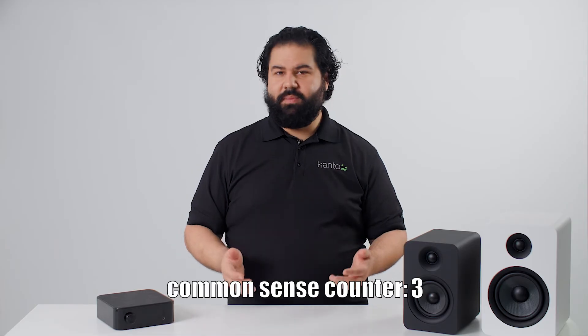The second spec is power, measured in watts. Some speaker manufacturers will give you a range of wattage you should use with their speakers, and others will give you just a maximum wattage. U-Passive 4-inch is spec'd at 70 watts per speaker, and U-Passive 5.25 is rated at 100 watts per speaker — that's the maximum power we recommend. If you send the speaker more than that, it won't be able to produce sound cleanly, it won't really get any louder, and you can actually burn out the voice coil — the thing that pushes the speaker in and out. The wattage rating on an amp is the maximum wattage it'll push out at its highest volume. You can connect a 200-watt amp to a speaker rated for 100 watts as long as you don't crank it to full. There's no issue in overbuying an amplifier as long as you use some common sense and keep the volume at an appropriate level.